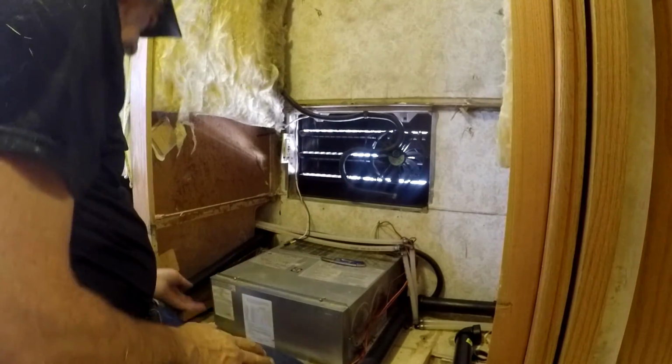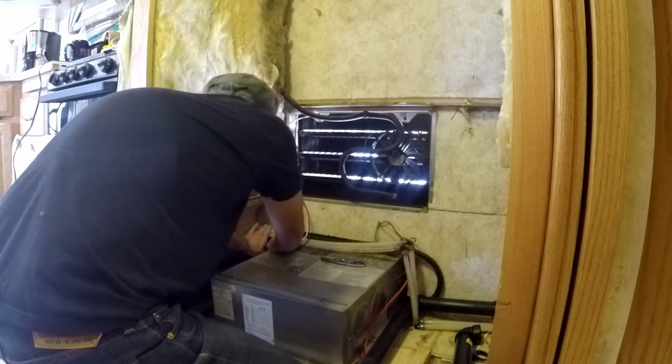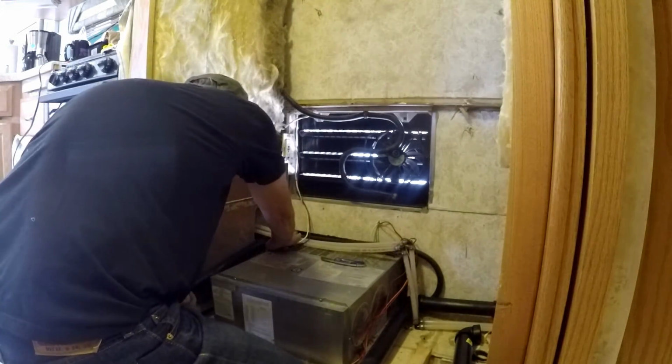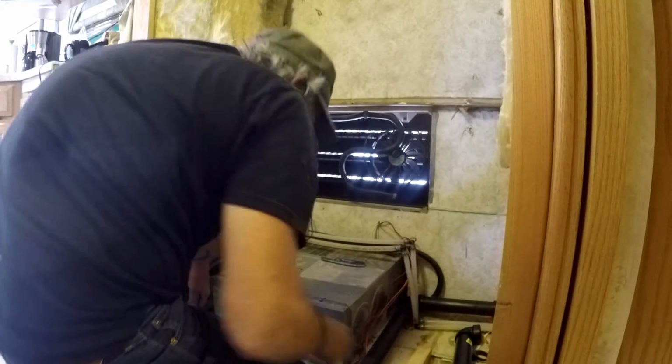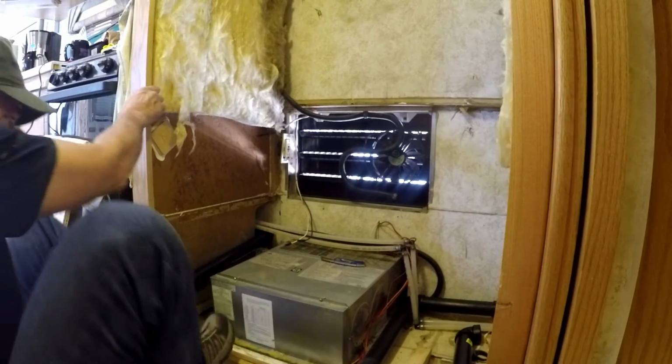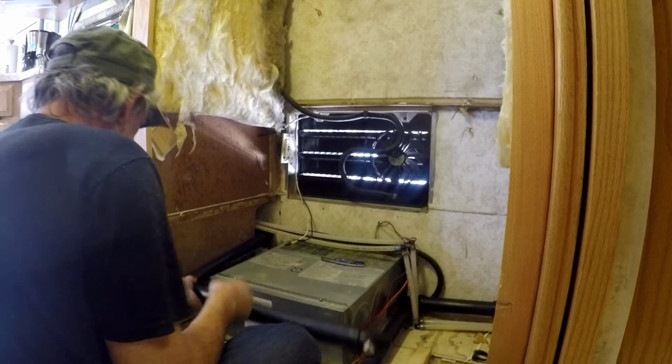Okey-doke, so we've got that drain line relocated underneath the water line and gas line there. And I did have to modify that cabinet a little bit with my utility knife. I chopped out that hole a little bit deeper so that I could bring that incoming drain line down. So it's fitting pretty good. I'm going to do a quick dry fit here.